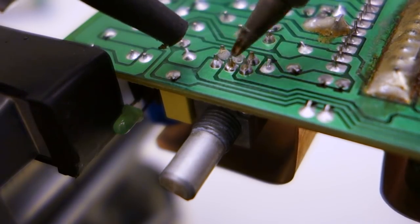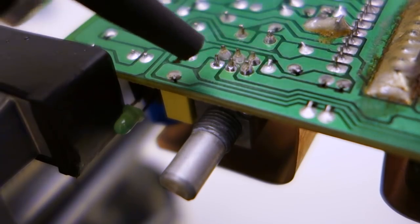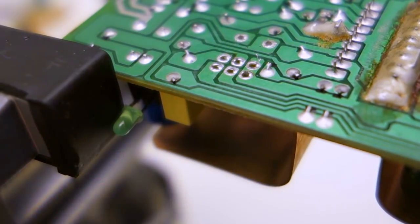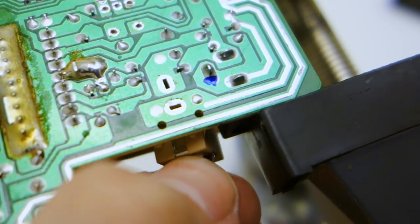First things first, I needed to move the volume switch from its position to be able to fit where I wanted it to be in the speaker enclosure. The switch was desoldered easily enough with a little bit of coaxing. While I was at it, I also removed the connector for the left speaker as well as the power jack, as that also will be located elsewhere.